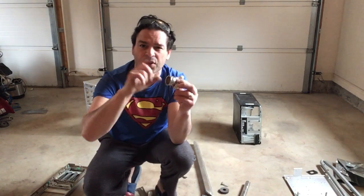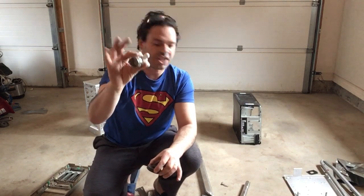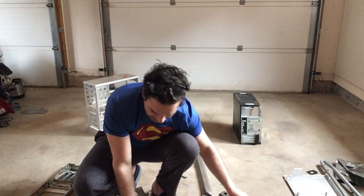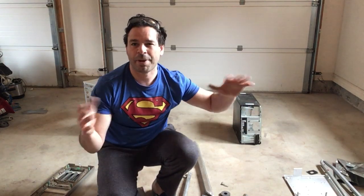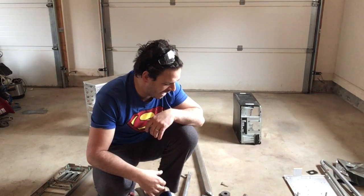So to recap: chrome - you want to do the scratch test and look at what's underneath it. If it is magnetic, throw it right into your tin or steel. High-grade stainless steel is non-magnetic and does spark. Aluminum is non-magnetic and does not spark. The spark test is the best way to tell the difference between high-quality stainless steel and aluminum. The magnet is the best way to identify tin and shred. Hopefully that answered the question - please keep the questions coming, welcome to all new beginners, it's a great way to make some money and help clean up the environment. Please comment, like, share, subscribe, and I'll catch you on the next one. Tin Man out.